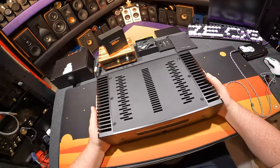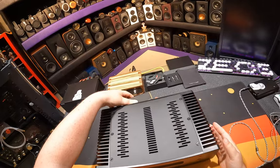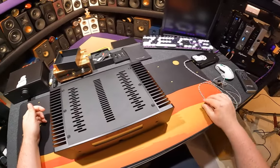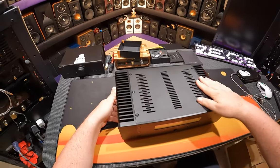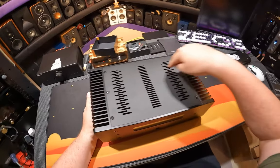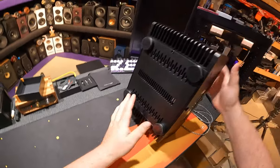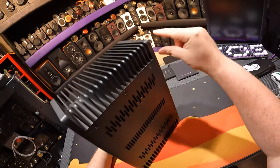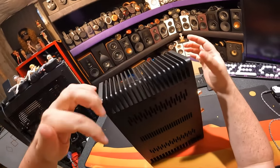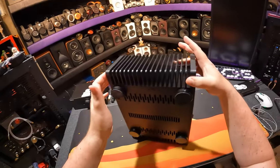So this is very warm, and also remarkably heavy. I think if you're going to pay $1,100 for an amplifier that's an old-school design, it should be built like an old-school amplifier — except this is built better. This top plate? Aluminum, with a beautiful pattern in it. They say each side heat sink starts as a five-kilogram piece of aluminum, and then 60% of its material is removed to make the heat sink.